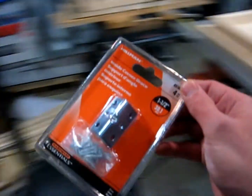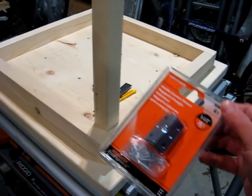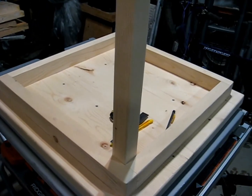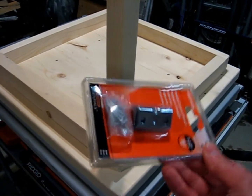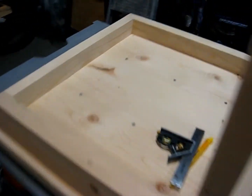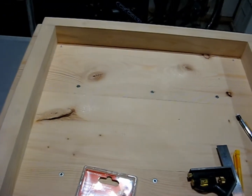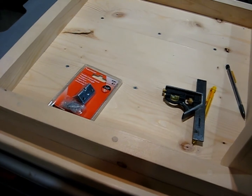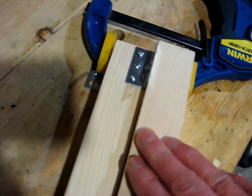The advantage of the corner braces is that the legs can be taken off. Also, in the future when my nephew gets older, the table can be repurposed — longer legs can be put on it or something like that — without destroying the character of the table. I've numbered each corner: one, two, three, and four, and I've also numbered a corresponding leg so when my brother takes them off, he'll know which corner each leg goes back into.